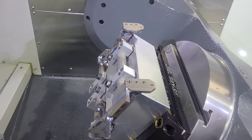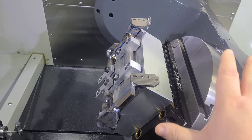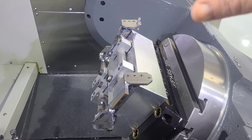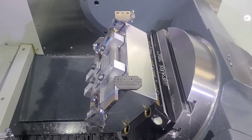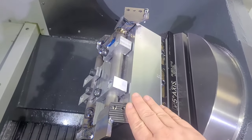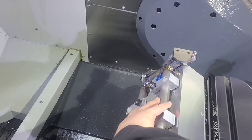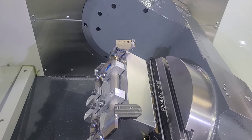So we have to use a tooling ball in here, and then we'll bring it around to the top plane so the machine is set right. Then we can pick up from this tooling ball — I'll show you how to do that. We'll be able to continue machining once everything's in the proper orientation and the CAM system can figure out the correct tilts to make the part. Now that we have our tooling ball in and the plane perfectly flat, with the center of that hole picked up, we've got to bring it to the vertical plane so the spindle is looking straight down at it.